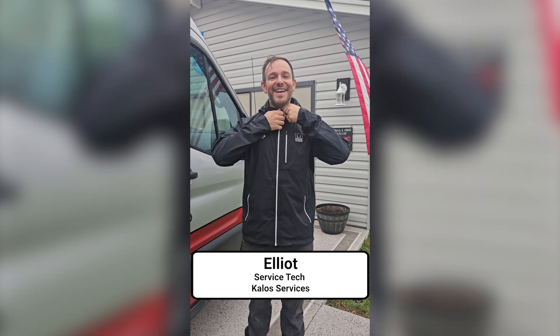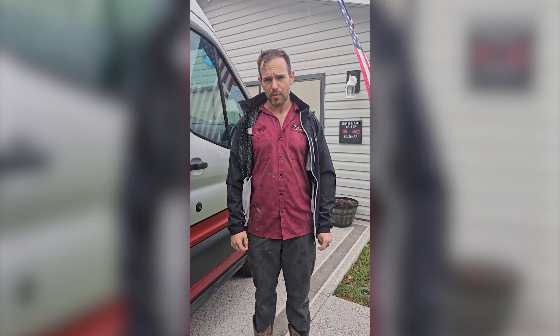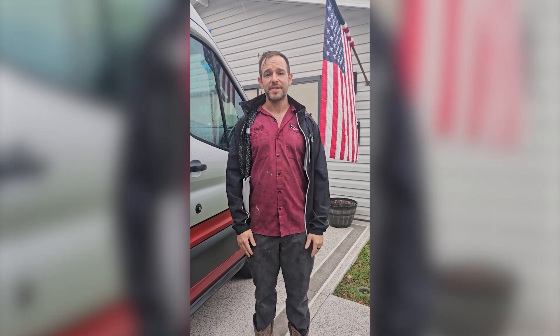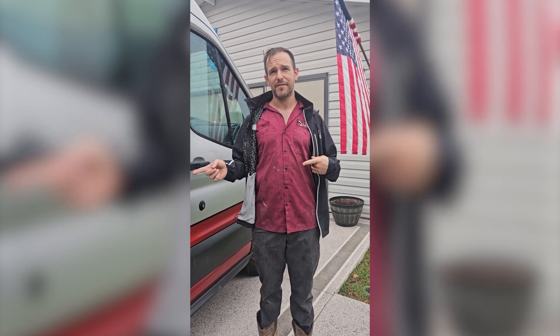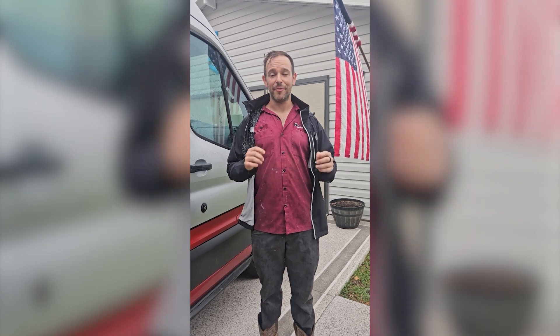Hello there. I am Elliot, apparently. Welcome to Adventures with Elliot. For those of you who remember Burt Life, he has ascended to a higher plane and can't make videos anymore. My lord Orr is busy with his podcast — check out HVAC School Podcast, highly recommend, sometimes incomprehensible but a lot of awesome stuff. Today we're going to be doing some basic maintenance. We have a Lennox system out back and I'll be showing some of the things we do to the outside unit. First thing we're going to do is check the capacitor, but before we do that we need to make sure we hit our disconnect — because who wants to play with 240 in the rain?